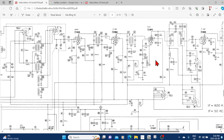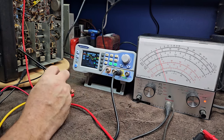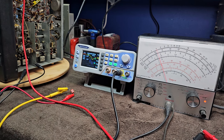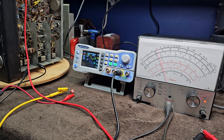You'll notice there are two adjustments for each of these transformers - one on the top of the chassis coming out of the top of the transformer can, and one on the bottom side of the chassis. They have to be tuned in the order the manufacturer recommends. Our setup uses the same meter connected to the same point, with the signal generator now set at 1650 kilohertz - just a sine wave, no audio tone - connected to the center gang of the tuning capacitor. We're tuning A6, A7, and A8, doing the top adjustment first then the bottom.